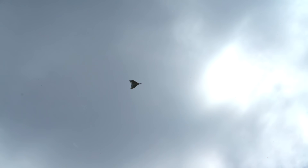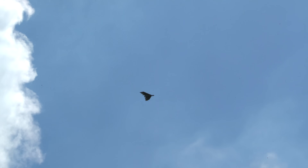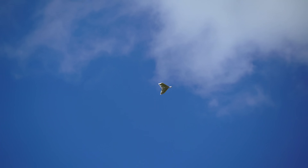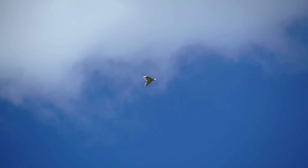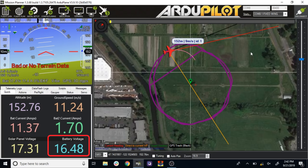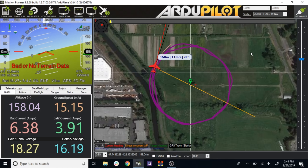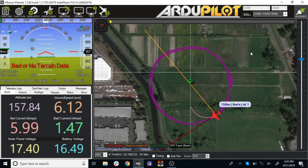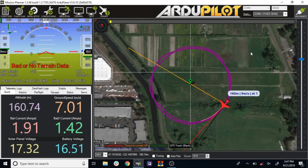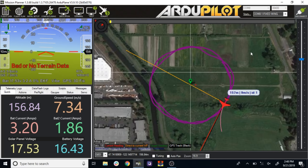It was suggested to use one current meter in front of the battery so charging shows as negative current and discharging as positive, but ArduPilot won't do negative battery currents so that didn't work. If we assume the battery voltage measurement is correct, it looks like this plane is flying on 100% solar power — over the course of the hour-long flight the voltage just bounces between 15.8 and 16.7 volts, and the battery is full at 16.8 volts so it never even got that low. This is pretty incredible considering there was cloud cover for 40 to 50 percent of the flight.